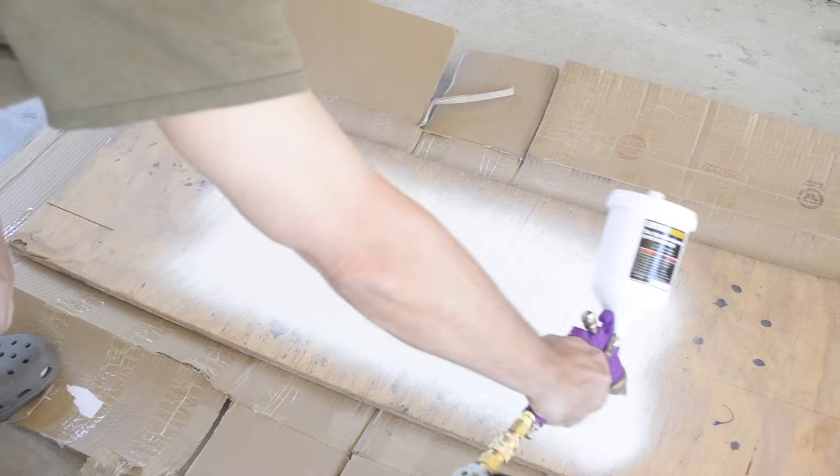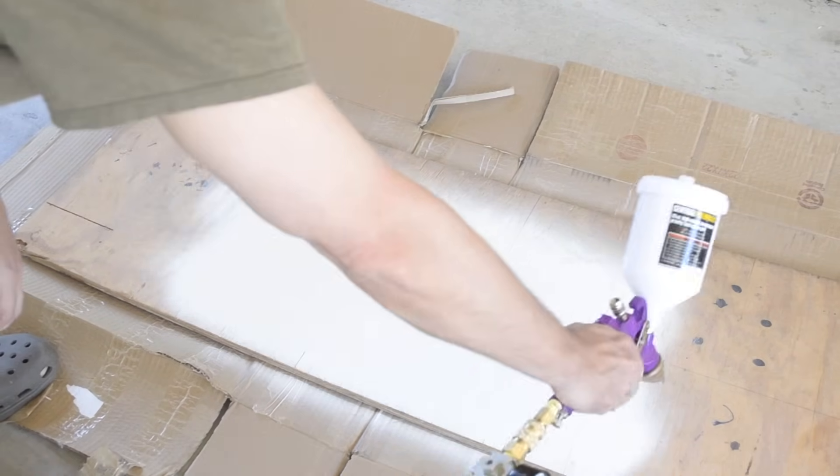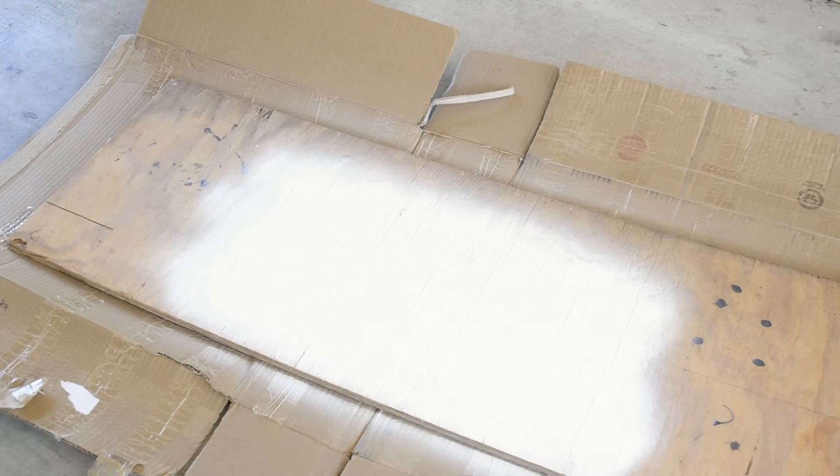My overspray really is minimal. My compressor is a little on the small side, so I can see that if you're going to work this way, you're going to need a lot of air — maybe another tank to add on to the compressor. I did try this with my other Harbor Freight turbine-fed sprayer and it would hardly push this paint through — it did nothing but spitting. This is so much more of an improvement. This may not look real good, but this is over bare wood with no primer, no sealer, and this wood has been outside for ages — it's just sucking up all the paint as fast as I can lay it down.